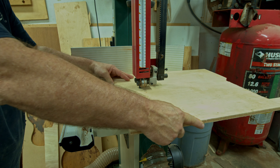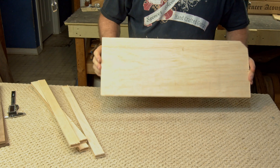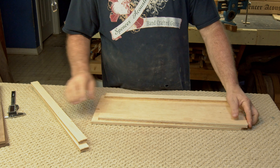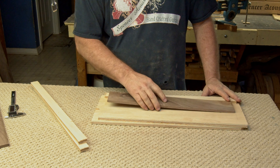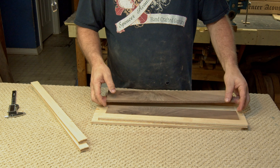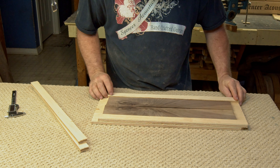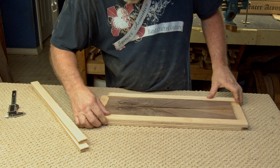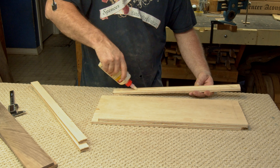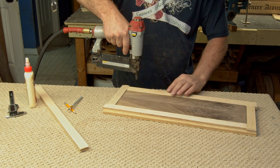Now it was time to make a small container to hold the wood and the epoxy. I started by making a base, then cut some strips for the sides. I'm going to use this piece as my base and cut those strips to make a frame — really all we have to do is contain the epoxy. I figure while I'm doing one fretboard I might as well do both at the same time. I glued and pin-nailed the strips — probably overkill; next time I won't bother with the glue.